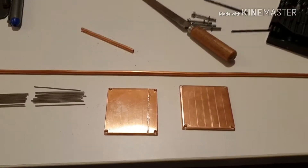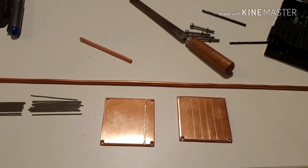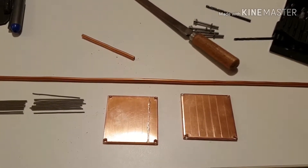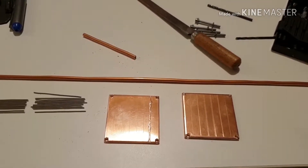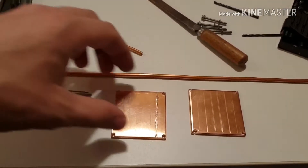It's time for a new approach. The heat exchange we were using previously just wasn't good enough. We saw that the Peltier was getting well below zero while the drink was still at 20 degrees. That temperature differential across the heat sink wasn't good enough — it was causing the Peltier to be inefficient and the process to be slow.